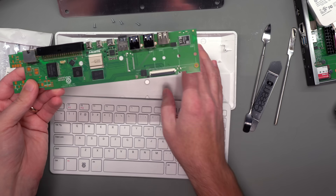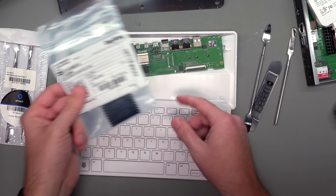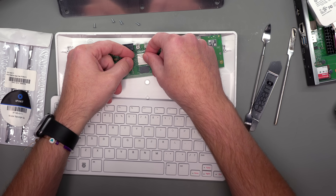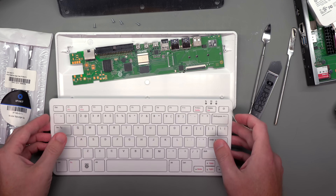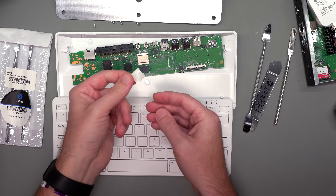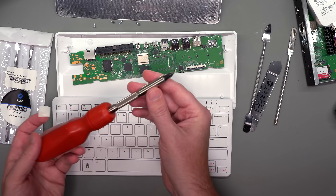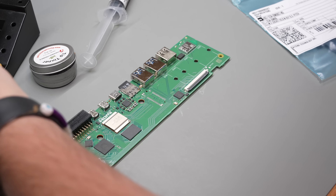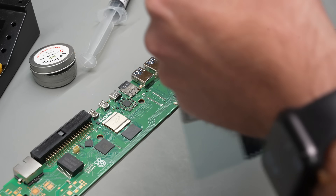The next step is I'm going to try getting an M.2 slot soldered on here, which I got from DigiKey — about four bucks each, and I bought two in case I wreck one. I should have bought five or ten just to have on hand. I don't have all the proper tools for doing this the right way, but I have some of the right tools to do this okay. This is just an M.2 E-Key slot. This is also the original thermal pad they shipped — you can see it doesn't even fully cover the SoC, and once compressed at the factory it doesn't spread back out like a replacement pad would.